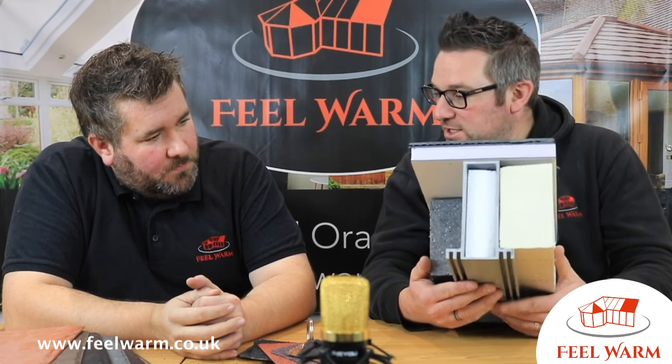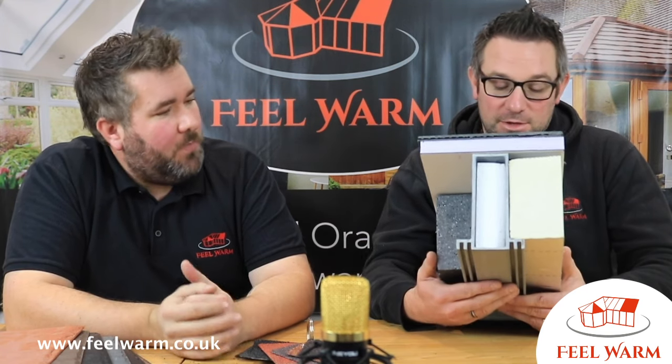And again, moving back to the insulated plasterboard, they can't connect the plasterboard straight to the rafter. So guess what they have to use to line it with first? Timber. And again, it's supposed to be dry timber. Not always the case, from our experience of these things done in the past. Wet timbers get delivered, and when questioned, it's a bit like, well, no, it'll be okay. It's like, well, no, we don't agree with that, and that's why we've strived to find a system that eliminates it.